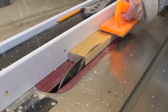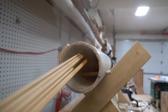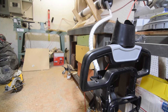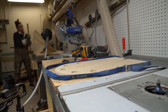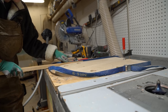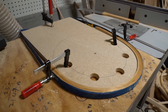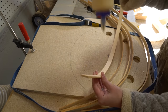With the seats roughed out I turned to steam bending the stool backs. I started by cutting more than a few five millimeter strips of three-quarter inch thick pine, then using the steam chamber I created in another episode, let those lamination pieces cook for a few hours at around 200 degrees. After their schvitz I bent the laminate pieces around an MDF form, using clamps and straps to hold them in place, letting them cool and dry overnight. The next day I glued the stacked pieces together and reapplied them to the form while the glue cured.